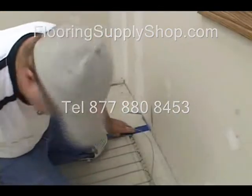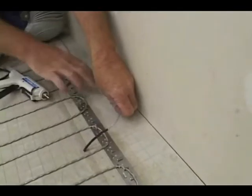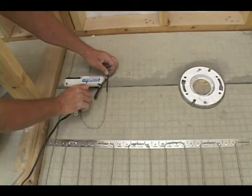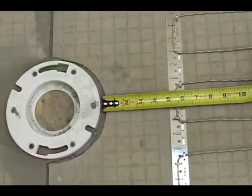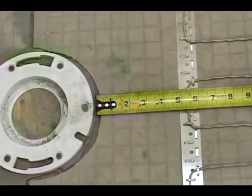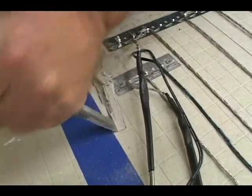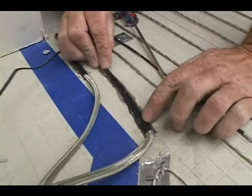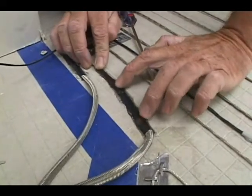When you have extra wire and need some place to put it, first consider the space near the wall. Next, look for spaces around the toilet. This area is not normally heated, but doing so does no harm as long as you stay away from the wax ring. After the wire is installed, we went back to our control location and made some adjustments. We lowered the profile of the power leads using a hammer and chisel and fixed them in place with hot glue. This makes it easier to install floor coverings later on.